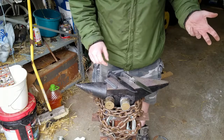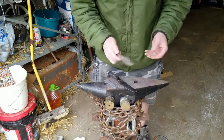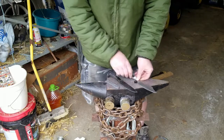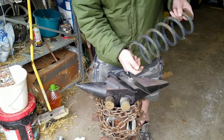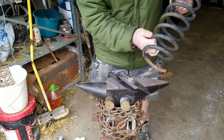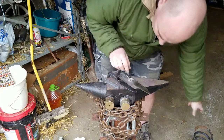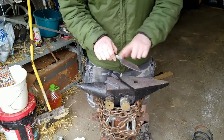But with the concerns about getting a harder edge, here's Mark II. What I did with Mark II was I took some coil spring — this is what's left of it. It came off the end of this guy that broke. I got new coil springs and thought, let's start making use of this, adding it into the knife. So I did this kind of Sanmai affair and got it in there.